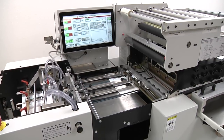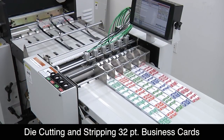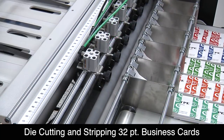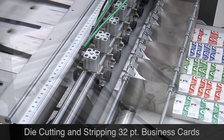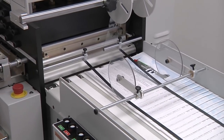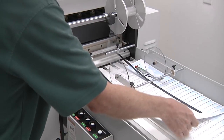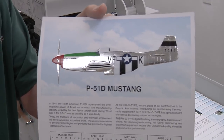All controls are conveniently positioned and easy to use. When die cutting, the Excel can be equipped with an inline waste stripping attachment. This attachment eliminates the need to manually strip a wide range of die cut products, improving productivity while eliminating manual stripping labor costs. The Excel is not just fast — it's also rugged and dependable. A computer-controlled automatic lubrication system provides precise lubrication to the impression mechanism. When not feeding paper, the Excel automatically drops to a preset idle speed to further minimize wear.